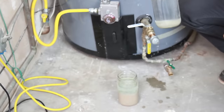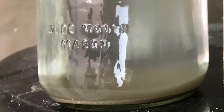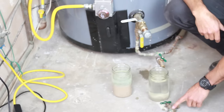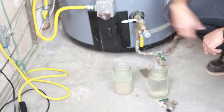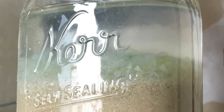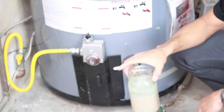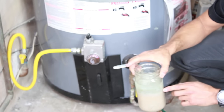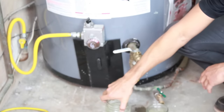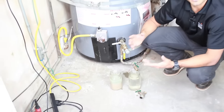Here is the result of our different flushes. Flushing through the small valve that comes with your water heater has a tiny little opening — maybe an eighth to a quarter of an inch — and if you look down in there, the chunks are really small; it's just fine sand that made it out. Actually, we ended up clogging the valve because it's just too small. Once we put on the large full port ball valve, we got four or five inches of interesting crusty rock-like deposits. This is all the sand and sediment that prevents heat from getting into the water. Flushing your water heater is super important to maintain the life and efficiency of your water heater.